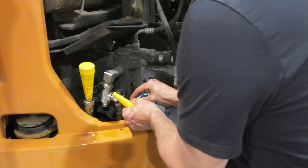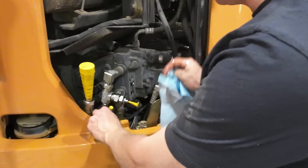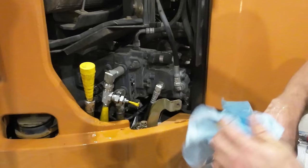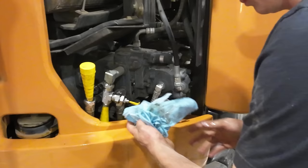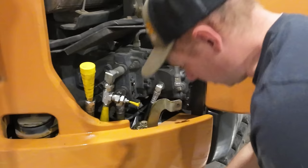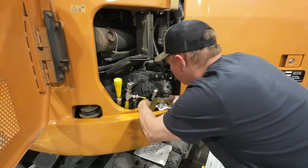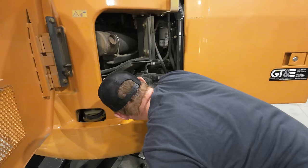All right, it's not actually under any pressure, so I'm just sticking these rubber stopper plugs in here for now to try to hold the oil in. And then I'm gonna have to loosen up the clamp on the line down there so it can slide down some and allow us to put the T in line. What a mess. Not much you can do about it in these circumstances though. Part of the process. Not a lot of room back here to work. Having a struggle getting a wrench in here to get on the line clamp that'll let it slide down for us.